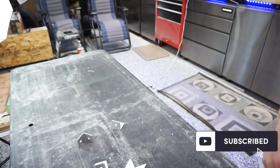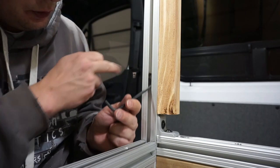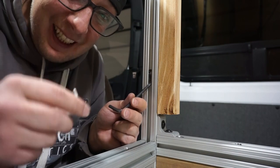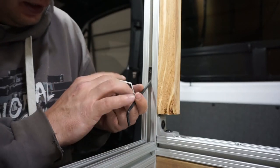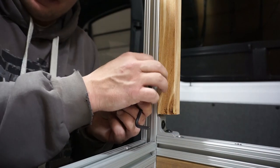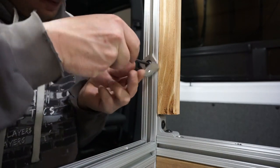You're welcome. And see, with our slider nut in there, now attaching these to an upright that always wants to fall down, that's another challenge. We'll discuss that in another 80-20 video coming up, because we've got a lot more to build. But using our custom brackets we made, I'm just gonna take our bolt, line up with our hole, and assemble it just like we did all the rest of them. And we're ready to rock, my friends. Tighten her down.